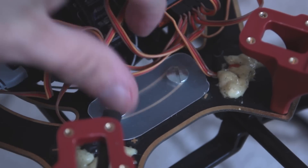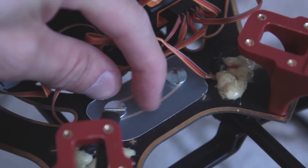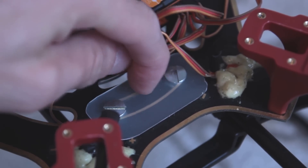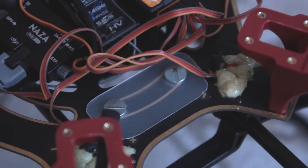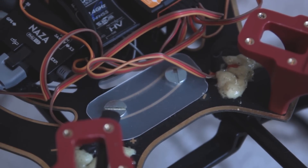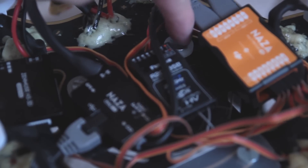Here is the inside of the DJI bottom plate where you can see I've used a piece of strong plastic to distribute the weight. I've put the bolts through it — obviously I've made holes there — so the bolts go through into the plates on the landing gear securing them fairly firmly. I've done the same on the other half as you can see under the equipment there.